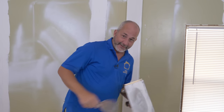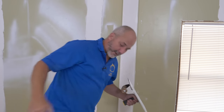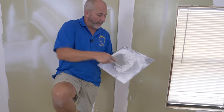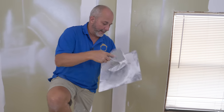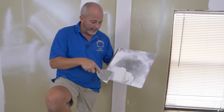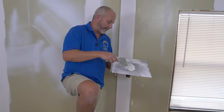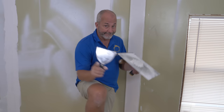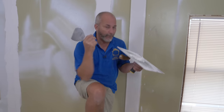I've done a lot of drywall videos and taught the entire course on how to be a professional drywaller from A to Z. In this one I'm going to show you the mud right out of the pan. When you work it — we call it tooling it — it gets a little creamier. Less is more in drywall. A thin coat means you don't get puck marks. That's really good to know as a newbie. Less is more because it gives you a smooth finish, and a smooth finish doesn't need to be sanded as much.